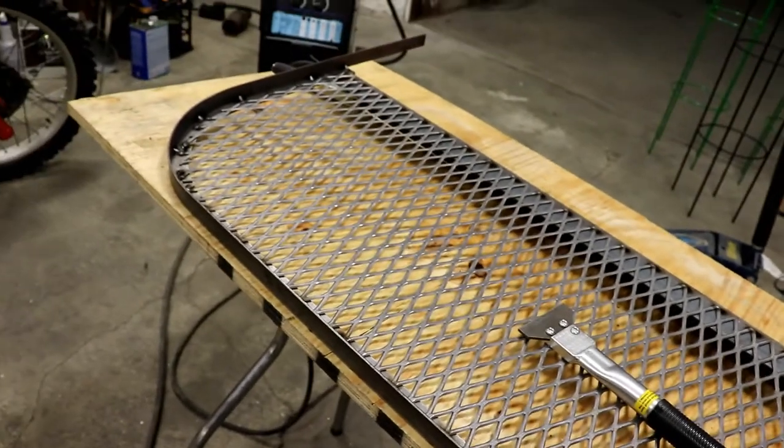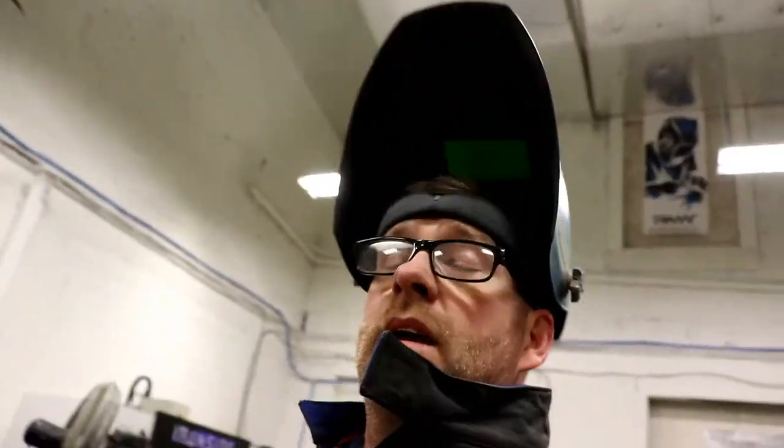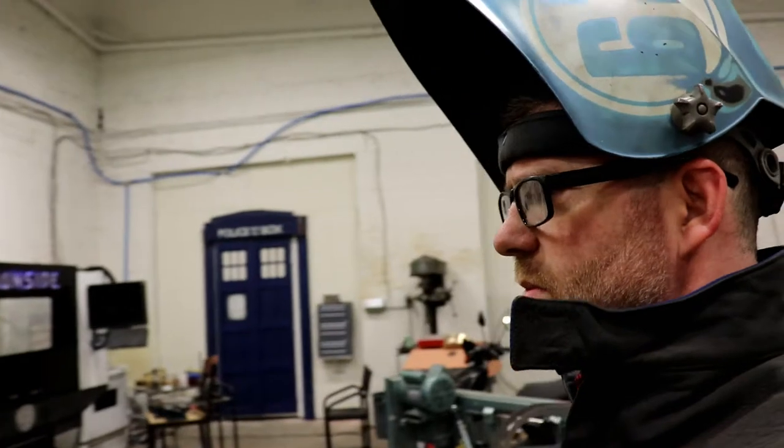We only have two more to make. That's about all I got for you guys today. So we got it all cut out, got the expanded metal working fine, cut out the eighth inch stuff, shaped and formed it, got the angle iron cut, and we got one pretty much 95% done — just need to weld on the back piece and do some powder coating. Stay tuned, tomorrow we'll get some more knocked out. This is a job for a retired customer who was in Florida over the winter and just came back, so I said I'd get it done for him. Hopefully you enjoyed that — if you did, stay tuned and subscribe and we'll finish this up tomorrow.